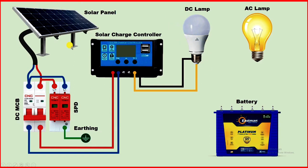If you do the connection in this way, your bulb will work through the power supply from the solar panel. That means only while the solar panel is producing power supply will this lamp glow. The moment the solar panel stops producing electricity, your lamp will turn off automatically. If you want this lamp to glow even when the solar panel is not producing electricity, you need to use a battery.